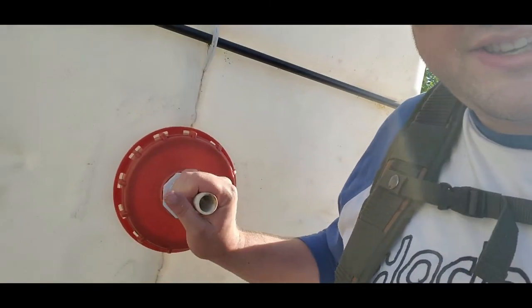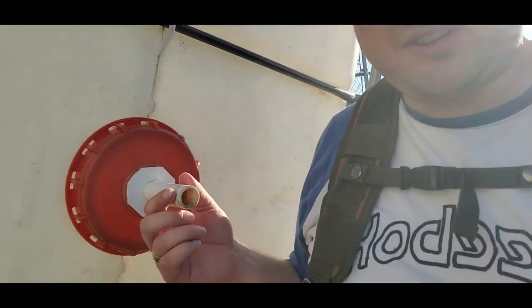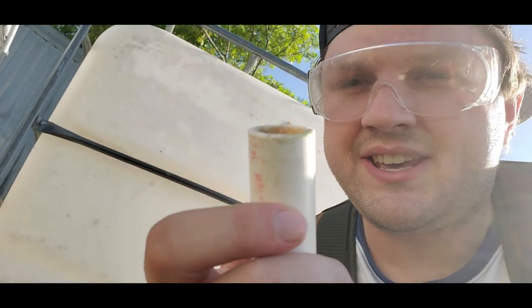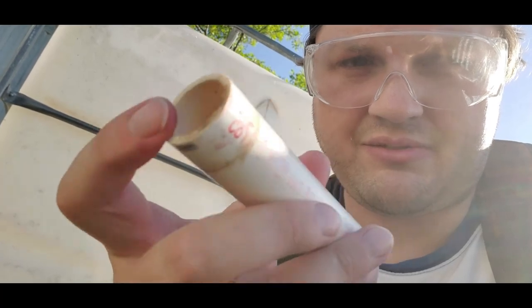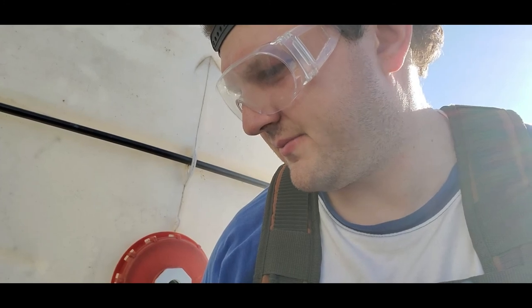But as you can see, it fits just barely in there. So I looked it up, and the outer diameter of a 3/4-inch pipe, which this is, which I know is not optimal for a drain, but this is what I got for now. The outer diameter is 1.05 inches, right, of a 3/4-inch pipe. So that was schedule 40, which this is, I believe. Yeah. All right, so anyway,